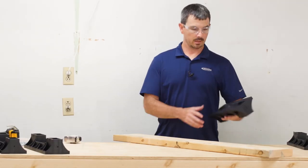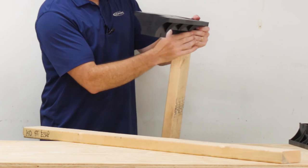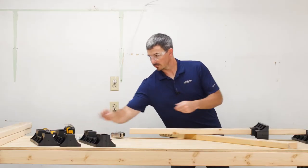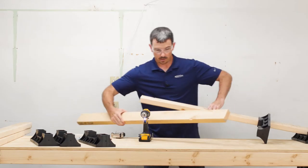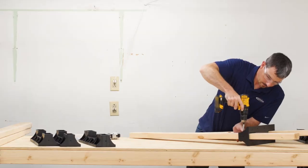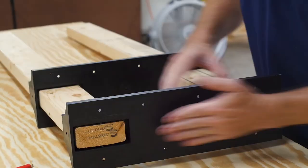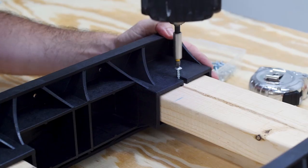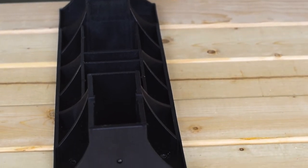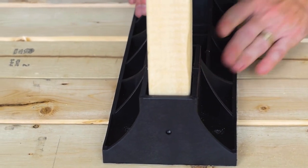The brackets on the bench face one way; the ones going vertical need to be upright. We'll position the bracket so the top of our shelf aligns with the mark, and do that for both sides and secure them. Slide the other board in to the same line, make sure it's square, and the top shelf will be flush at the very top. The shelf link sets flush to the workbench — insert the height board right in there and that becomes your base. Let's go ahead and assemble that.